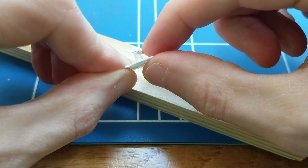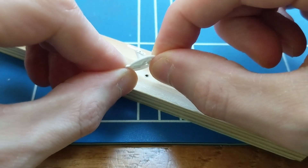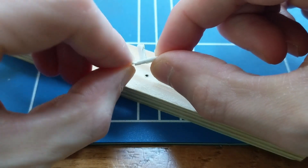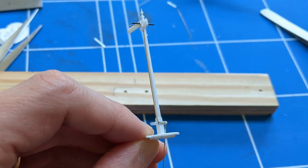It turned out that a 0.3mm hole through the plastic post base holds the brass rod tightly enough that nothing else is needed to keep it from working loose, which is helpful. Another thing worth noting is that the rod linking the signal arm with the balance lever is extremely difficult to bend in exactly the right place, such that the signal arm ends up level when the balance lever is level.